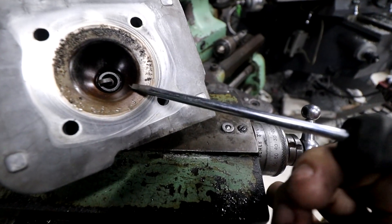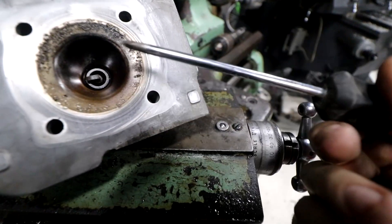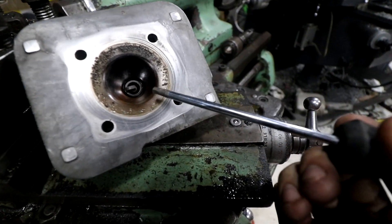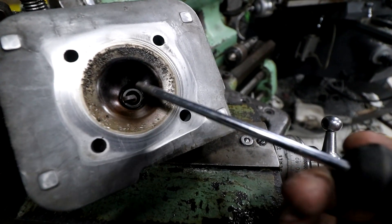What I'm going to do is reshape this piece and then machine down the mating flange here to match, to try and keep the compression the same. I don't know if that's the right way to do it but I don't really care. And I'm going to change the angle of the squish to change how the air goes under the inside.